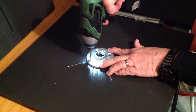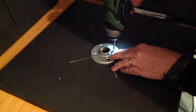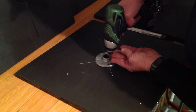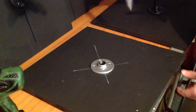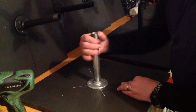You're going to put that right over those just like so, and you're going to use your screws — they're number 10 screws that are 3/4 inches long. It won't go through the board because the flange is going to make sure that it won't be able to pass through. Just take a driver, put it right through the center of that and drive it right through. You're going to put all four of those screws inside there just like this, get that to seat in there really good — use your wood screws of course. Then you're going to go ahead and screw that flange right into the pipe, or the pipe into the flange just like so. Once that's secure, you can take that anywhere with you — your base plate is going to be strong, painted of course so it's finished off.